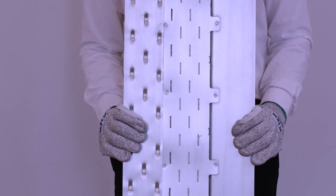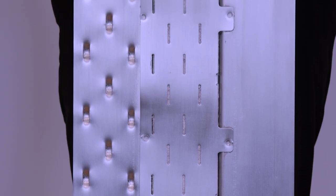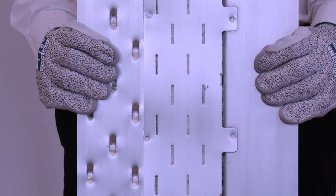However, Keystone has developed and patented technology to enhance the structural performance of the lintel without compromising the thermal performance. Keystone's cleverly designed and patented thermal brake plate has intermittent tabs that connect the outer leaf to the inner leaf. This means there is a reduction of 90% of contact between the cold outer leaf and the warm inner leaf. This simple but brilliant innovation is enough to significantly reduce thermal bridging while adding vast improvements to the structural integrity of the lintel.